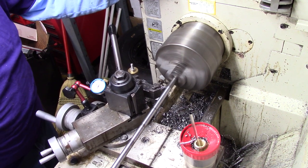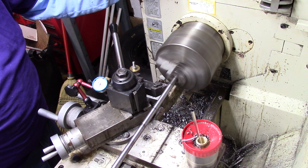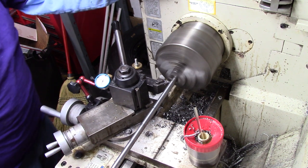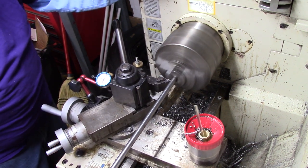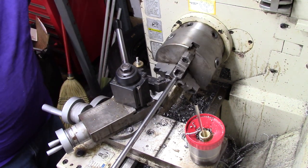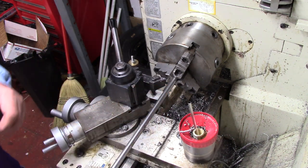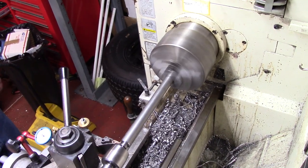What we're doing here is turning down just the dowel end of this piece of half-inch shaft so it'll fit in that bore. I'm going to work right up here close to the chuck, then back everything off, grab some sandpaper, and polish it. I know it's not completely round — it just needs to slide good, that's all we're trying to do. Now this is the tubing just cut down.